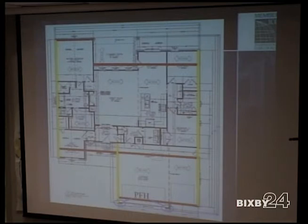For the calculator, whenever you're putting that information in, go ahead and print it off and have that with your plans, because that tells Bill what parameters you used. I don't know how thoroughly he looks at them, or if it's just spot checking, but you're putting all the parameters in. If someone says, I'm going to fudge this one so I don't have to use as much bracing, I'm going to say I've got 9 feet of eave to ridge height, when actually you had 20, it's a way to spot check. So that would be required as part of your documents.